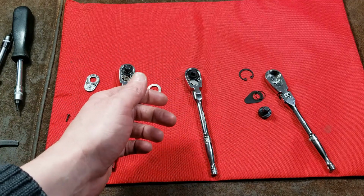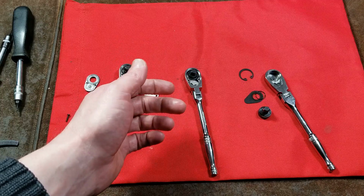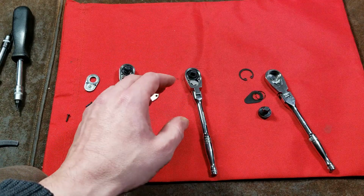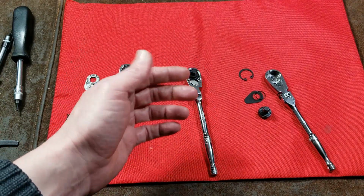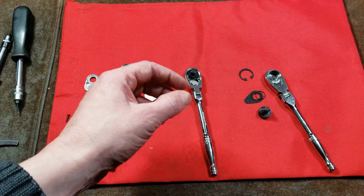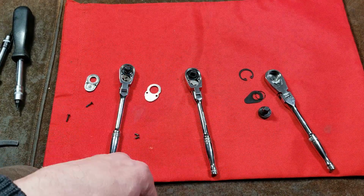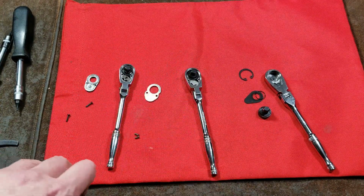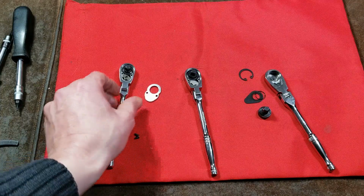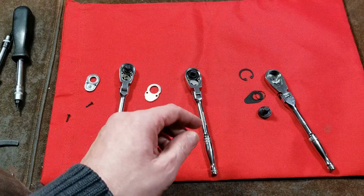You take apart any Sawzall that's been made in the last 5 to 10 years, probably 10 years, they all have 4-tooth motors. And they look odd. You're like, wow, that's a really coarse 4-tooth motor. That cross-sectional area really makes a difference and is what they have standardized on. So it's another real-world example of why the whole battle for finer teeth really is kind of a red herring.